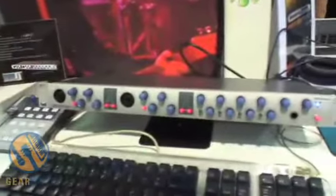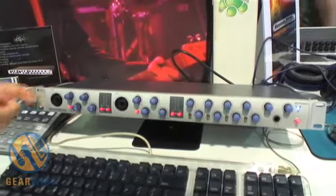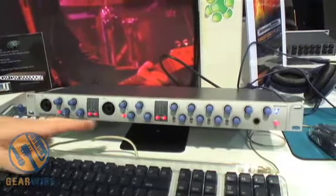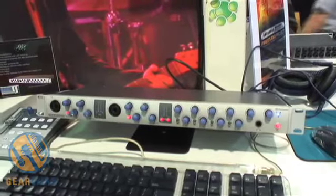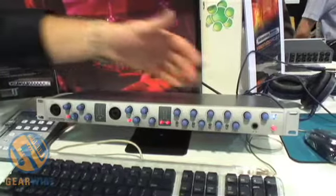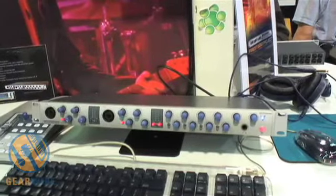So we're very excited about this piece. I believe it to be really a first in the industry — I haven't seen anybody else really put something together like this. What we're looking at is we've got two tube channels right here on the front. It's a little 12AX7 tube here. Each channel has its own gain, limiter, tube drive, and gain makeup. Both the limiter and the roll-off for the channel are defeatable. So the first two channels on the front are little mini super channels. We then have eight more XMAX mic preamps on the back, giving us a total of ten preamps at one time.